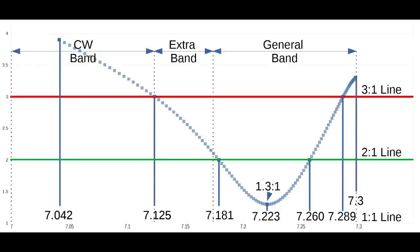So I just thought I'd put this kind of in our back pocket for use as an antenna, if we're looking for something on 40. It works great on 20 meters. It's under 2:1 SWR across the band. So there is our DXEE Alpha Delta antenna redux.